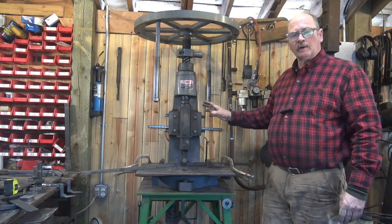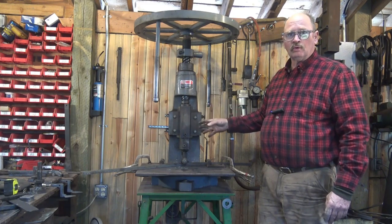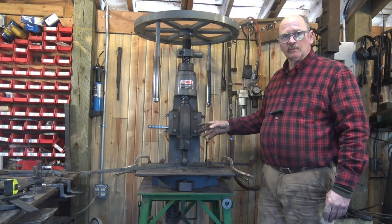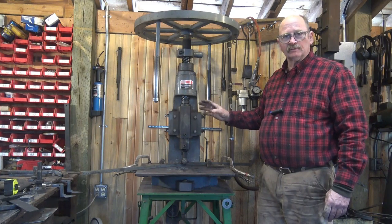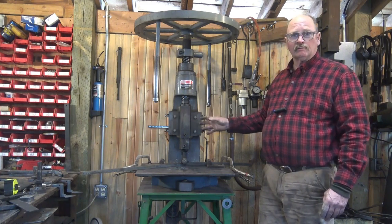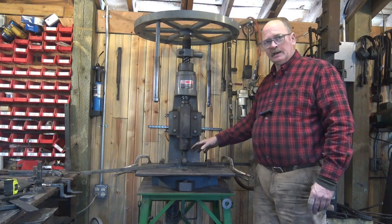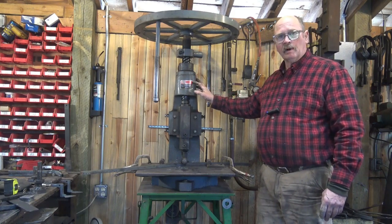That just barely scratches the surface on what you can do with a fly press. It'll punch holes, it chisels, it chases, it does decorative forgings. You can shape shovel pans and candle holders under it. And I think when we did the candle holder video, we might have actually shown doing a candle holder under this. Lots of things. This is a fairly large one by modern standards.